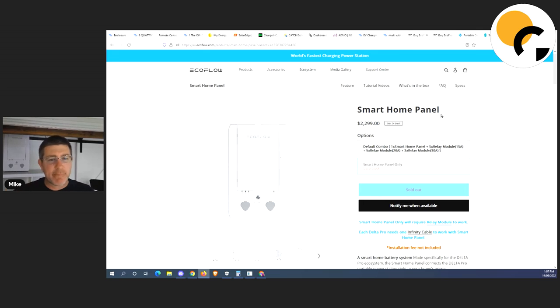There's a lot of moving parts in my system. One of the things when I first got into solar that always annoyed me was I wanted to design solar systems that just work — simple and easy. This smart panel I've been testing and playing around with is pretty exciting. What it actually is, you rip out your old circuit board at home and replace it with this, and it's full of contactors and relays. Through an app you can say: when the batteries get under 80%, dump that load back to the grid — turn this on, do that. There's lots of smart things you can do with this smart panel all built in.